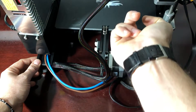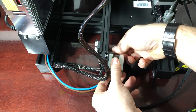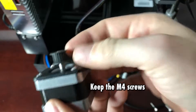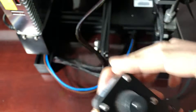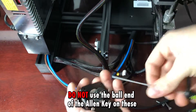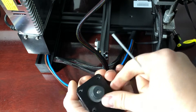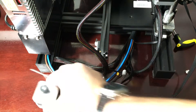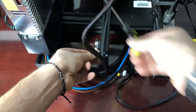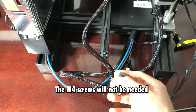Then we move to the back of the printer and take out the bracket that holds the Y-motor in place. You do this by undoing the two screws and then disconnecting the motor. As you can see, these are press-fit pulleys so we're not going to remove them. Now remove the four screws that hold the motor to the plate. Don't use the ball end of the allen key because this could damage the screw and make it unusable. We will need the four screws — two per each motor — so set them aside. Also keep the small black plate. When done, remove the Y-stop by removing the two screws on the side and gently removing the connector. Those two screws will be replaced with longer ones.